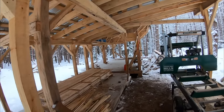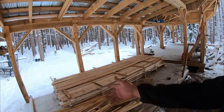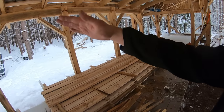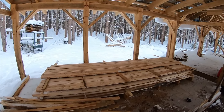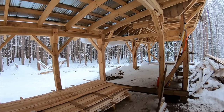We added a few pieces of lumber, some 2x4, some 2x6. You guys saw me stack it up there. I sticker it. I put spaces not only between the rows, but I also put spacing between the boards. As this dries, it'll become very useful for me in the future. I plan on filling up this shed, then we'll head over to that shed, and eventually we'll have a huge pile of lumber, and I'm going to use that to build some future projects.